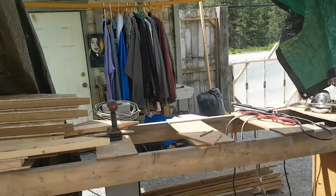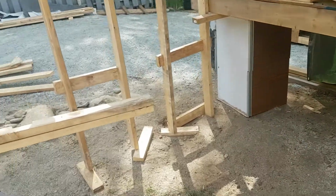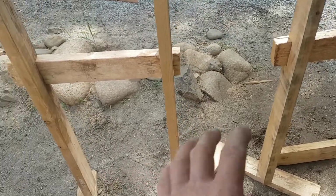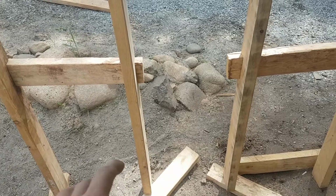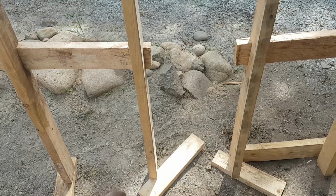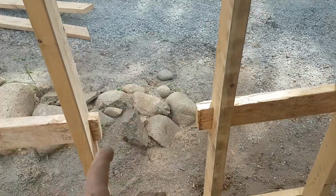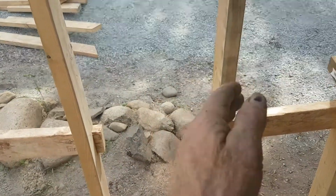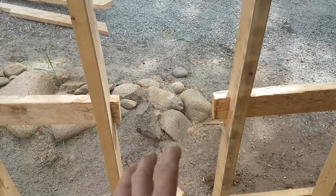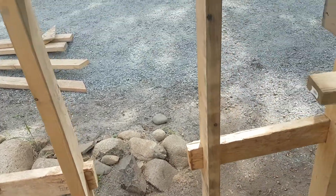Less than about 500 lineal feet of 2x4, so you can make this for cheap. And on the feet this morning, I figured out, the Lord showed me to put a 2x6 down, like a 2x4. Get a 10-foot, and then I'll make a little fill in between here with the 2x4, and take some of my leftover plywood, and I'll make some side gussets. Then I'll put that in, screw it down, and I can screw into here, and that will secure it.